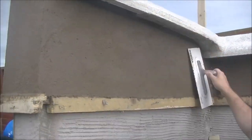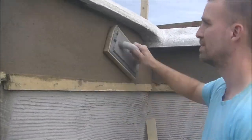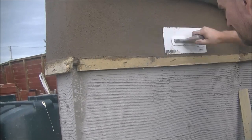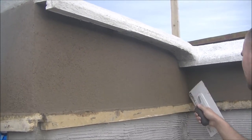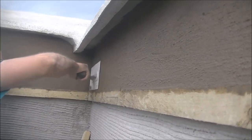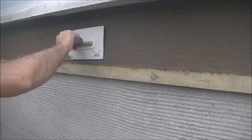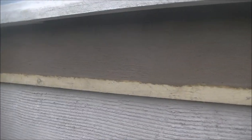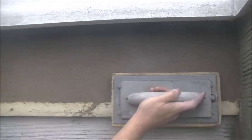Just using a small tool up into the wee awkward parts as well, trying to keep the top nice and clean. Don't want any snatters along the top edge there. I definitely do like the refining sponge float — find it pretty comfortable, sometimes a bit better than the car sponges. Just depends on what I'm doing. You don't want to catch a plastic float off them heels or it might ruin it. These things have been lying about in the van, so I can tell you they're not going to break just too easy, but a chip on them might be a wee bit fatal — might be hard to get them grinded out.